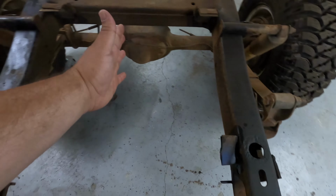All right, we got a plan. Have a scrap bolt. We're going to try to weld it onto the end of this and unscrew it. Hopefully, it's pretty rusted though, but we'll give it a shot. And then once we do that, we'll start in here. Let's get the welder out right quick.